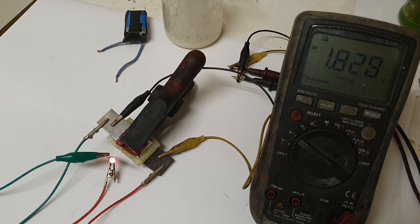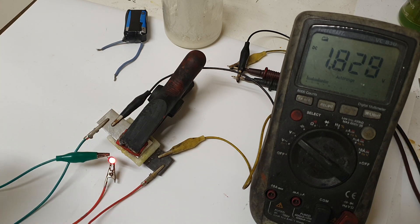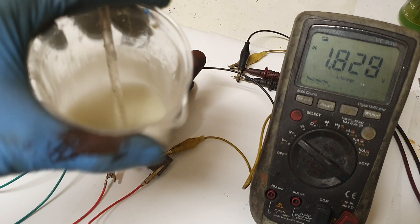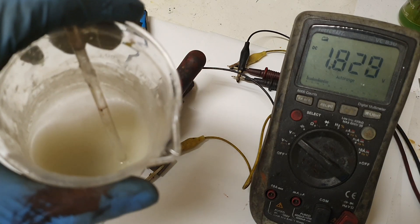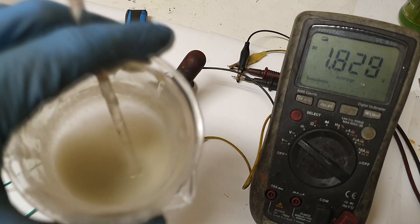The design of this battery is quite simple. The negative electrode is made from aluminum. The positive current collector is a graphite plate. I also use carbon felt to store the bromide, along with a separator and the most important part — the electrolyte. In this battery, I don't use a water-based electrolyte. This is actually an aluminum bromide electrolyte in a eutectic solvent.